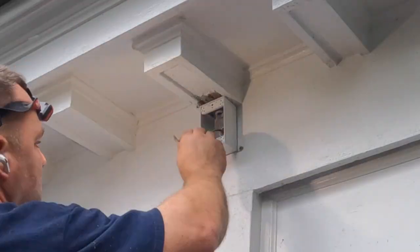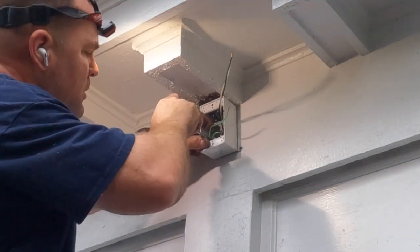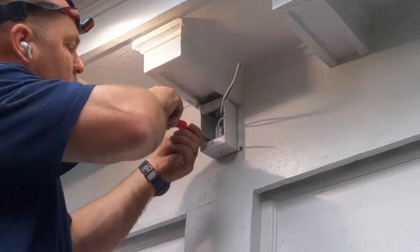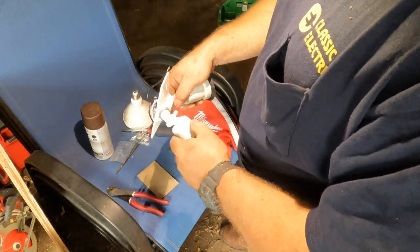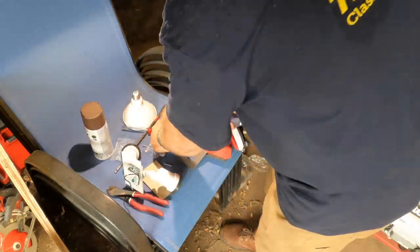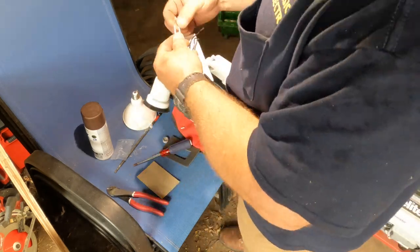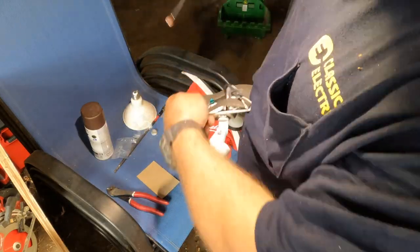I'm using two-and-a-half inch corrosion-resistant screws going through what looks like two pieces of three-quarter inch lumber. Make sure you bond the box — wrap the ground wire around the ground screw provided with the box, that's a very important detail. I like to assemble the flood bulb holders on the ground at a level surface, pre-wire them, then go up the ladder and attach the assembly to the box, put in the bulbs, and we're all set.